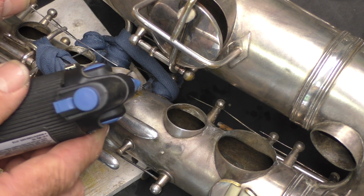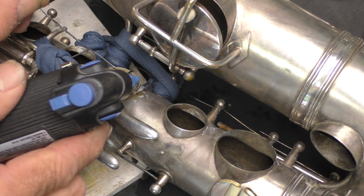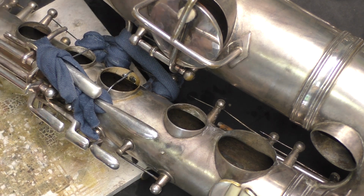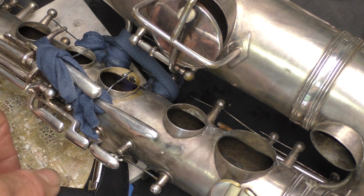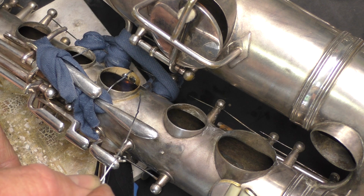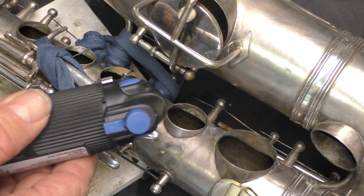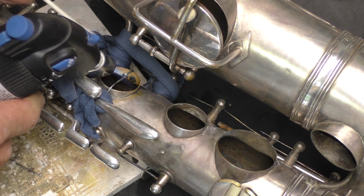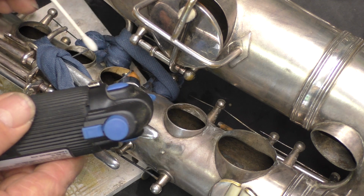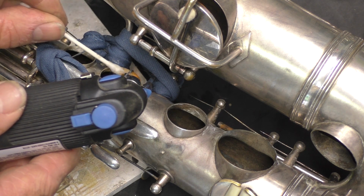Okay, here we go. I'm going to try to keep the heat on the body more than the actual ring. See, what I need to do is get it in that crack and sweat it. I'm going to try putting the flame from underneath on the body for a bit. See what we get. Okay, let's get some of the solder off from there. Don't really need that in my way. Q-tip with some water on it. Wet rag also works if it's a larger project. Just got to get it to where the solder's molten, and then just give it a wipe. It'll wipe right off.